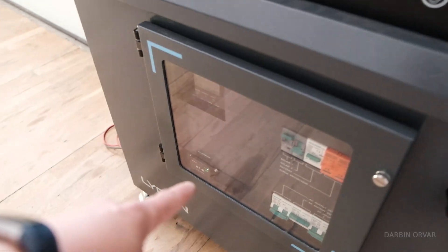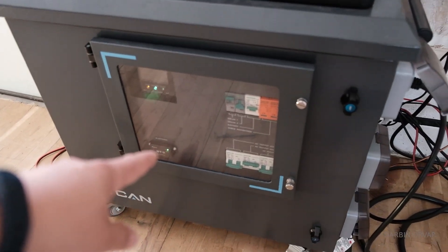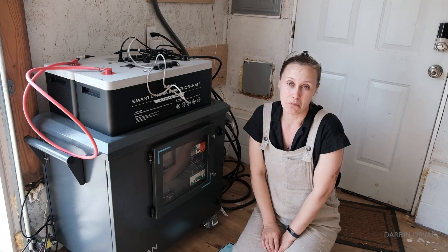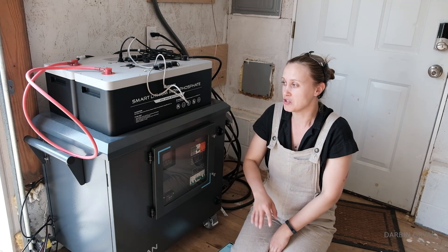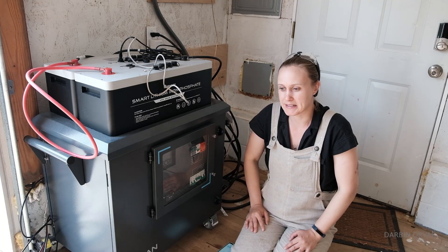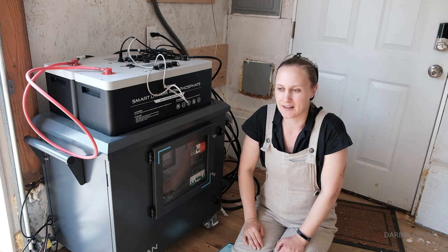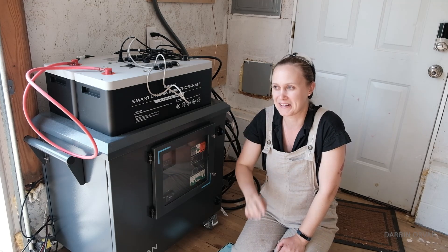The system needs you to connect these specific batteries to it — you don't want to mix brands and models. Use the same type of batteries so you won't have any problems. And definitely do not connect them in series; the manual actually says 'catastrophic failure' if you connect them in series.